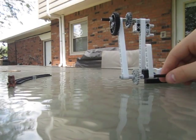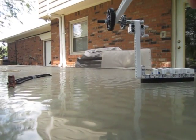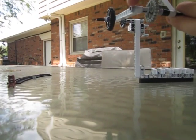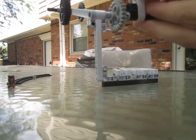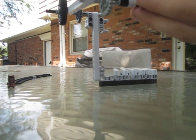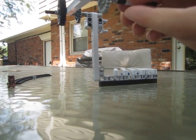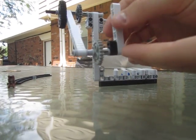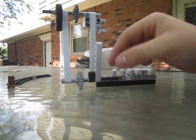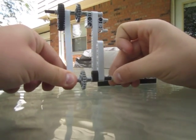One thing to point out if you're building a chain bar: the axle at the bottom needs to spin freely around the pivot point down here, but the axle also needs to be fixed to the arm. So your sprocket at the bottom needs to be fixed to your arm or hopper area. I'm going to stick one more spacer or axle collar on the end right there.